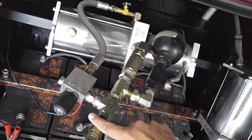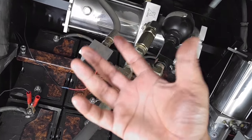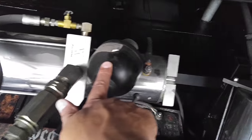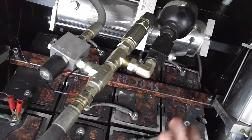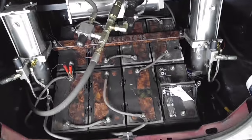This is the giant check valve on the front versus the little tiny check valve on that one. This is just another standard oil system dump — there are really nice ones called square dumps, a Dell and a Dex, really nice and really expensive. I used to have a Cadillac that had two of them but I sold that years ago. Last thing you see here is an accumulator. Fluid doesn't compress like air does — think of a syringe. Inside the accumulator there's a rubber balloon filled with nitrogen that squeezes as you go along and lets it have a little bit of play so it rides softer. This is a shutoff valve because if you want to hop, the accumulator can kind of get in the way, so I can shut that off.